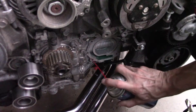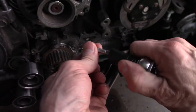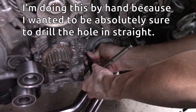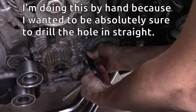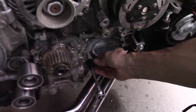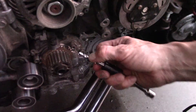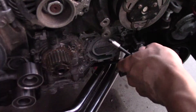First thing I've got to do is put some cutting oil in here. This drill has a square end on it, so I'll just use my tap driver socket and use the tap guide, which is going to help me get this hole started perpendicular. Feels like it bottomed out. Let's check this with my sophisticated depth gauge. That's how deep it is, that's how long the insert is, and we're good.